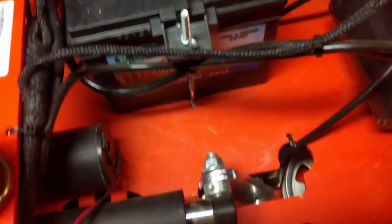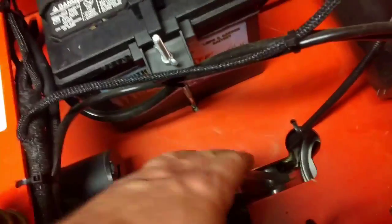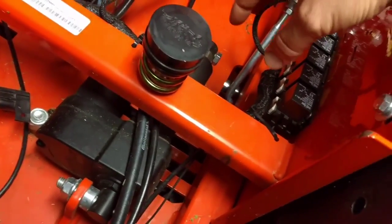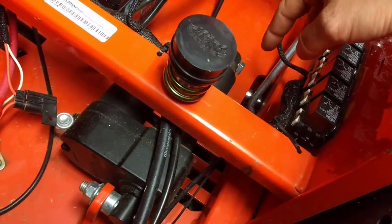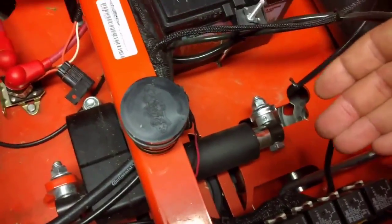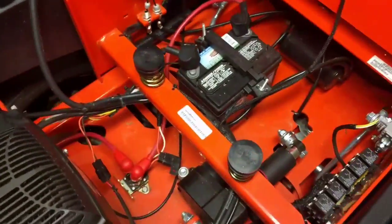It's got a pretty hefty cylinder on there, which connects to this control arm. And there's the actual motor right there — easy to get to if you ever had to replace it. The ratings on this: it's supposedly got a static hold capacity of 3,000 pounds, a normal operating capacity of 1,000 pounds, and this seven-gauge deck supposedly weighs 250 pounds.